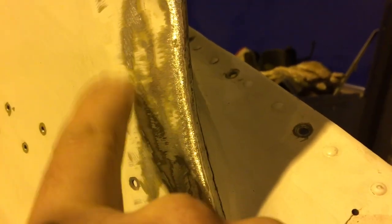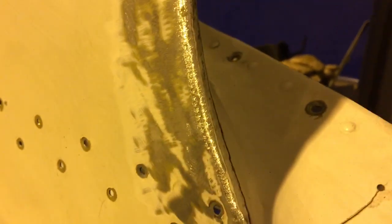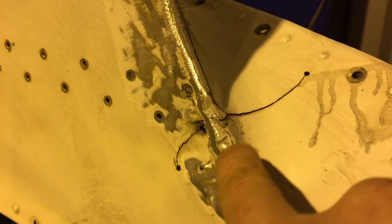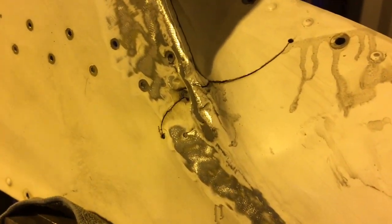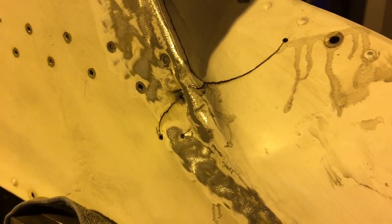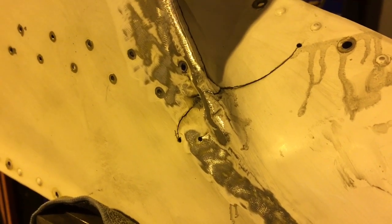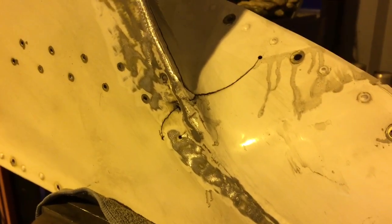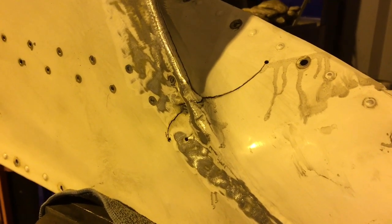Here's a shot of it from the outside. I've carefully started on it with a flap wheel. I'm not going to try and paint out these low spots because all I'll do is thin the metal on the high spots — that's not what we want. So I'm going really carefully, just barely taking the paint off. Some of these rivets have been smashed down and bludgeoned. There's a lot of extra thickness of weld here; I'm just going to grind a bit of that off, then clean the paint either side of this weld. We'll go to the blaster and try to get some of that alodine chromate nasty stuff off the inside, because welding on that is going to get in your lungs and kill you. That's probably why you've got to charge enough for these jobs — it's not simple to do things properly; it takes time, effort and dedication.